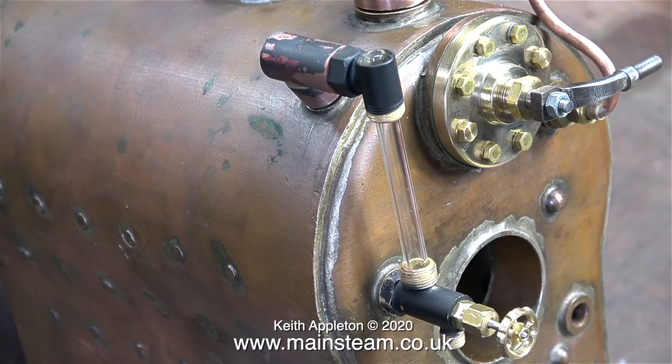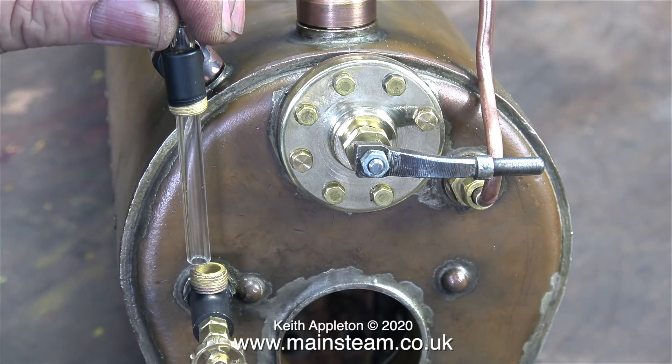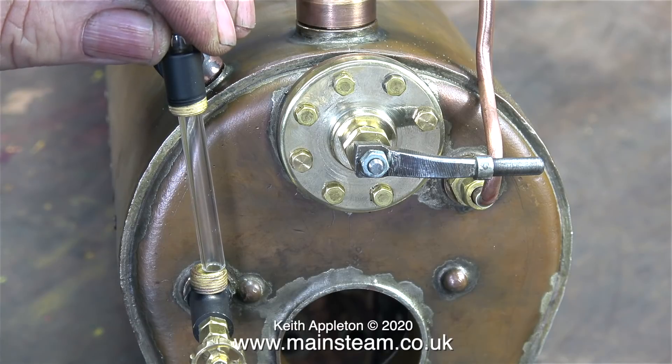I've been making a lot of things like this recently so I omitted the silver soldering operation. But unfortunately I made a mistake. If you look back at the chamfering operation it's too deep a chamfer, and I think the top part moved slightly relative to the main shaft when it was being silver soldered. The sum total of these two errors means that the top fitting doesn't stick out quite far enough, so the water gauge top fitting does not align with the water gauge bottom fitting. I had three choices: start again and make a new fitting, use a thick washer on the top part of the water gauge where it screws into the fitting, or what I chose to do — screw the bottom fitting into a 5/16 by 32 union nut, clamp this union nut in the three-jaw chuck and reduce the thickness of the hexagon part of the lower water gauge fitting, then cut the thread all the way down to the hexagon part. We all make mistakes and I like to show mine. It was a simple fix and here I'm checking the alignment of the water gauge glass tube.